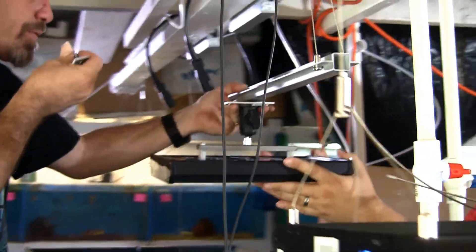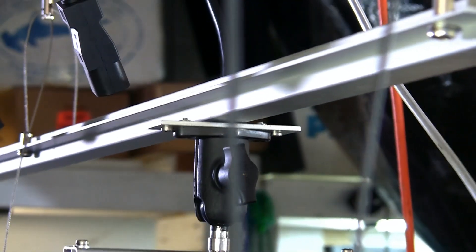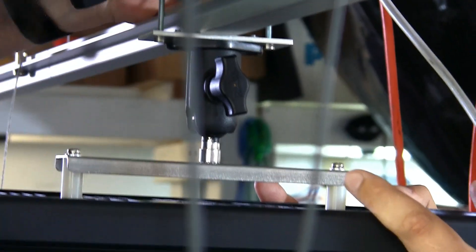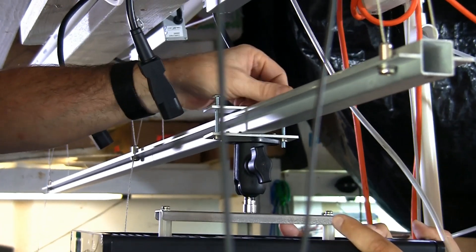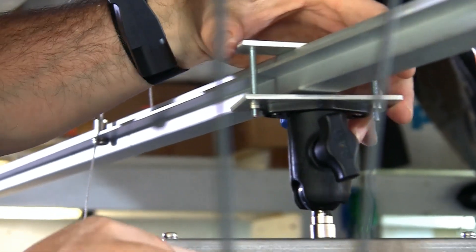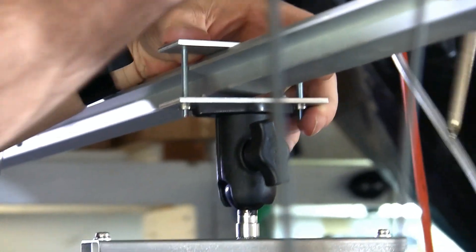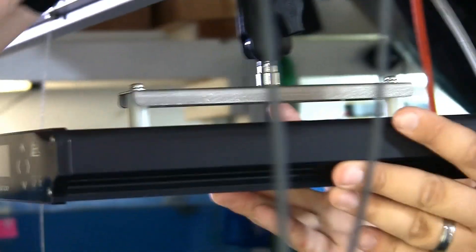Where are we putting the lights? So we'll be mounting the first light — there's a clamp that will bolt over the rail itself. As you can see, the swivel ball mount is below it, and there's a bracket that in turn attaches to the light, so as Scott gets the nuts tightened on the bolt. That squeeze clamp allows him to slide the mount back and forth along the rail. The swivel there allows the light to be adjusted — or as Scott says, articulated — so that you can aim it in different directions.